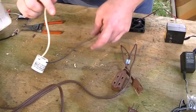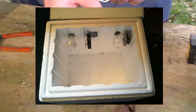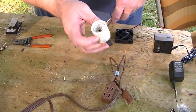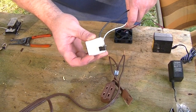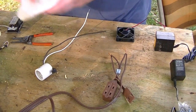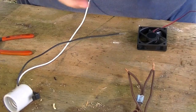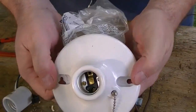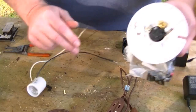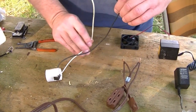Okay guys, for today's demo we're just going to use a single socket. I like these insertable ones — we cut an inch-and-an-eighth hole and these fit in perfectly. We silicone them in there and it's a lot neater, with less room taken up in the box compared to the whole socket style you get for a buck and a quarter from Lowe's. Those will work just fine too — same principle, just here's where you fasten your wires. I use wire nuts to hold everything together.